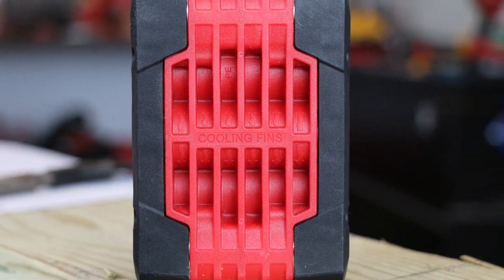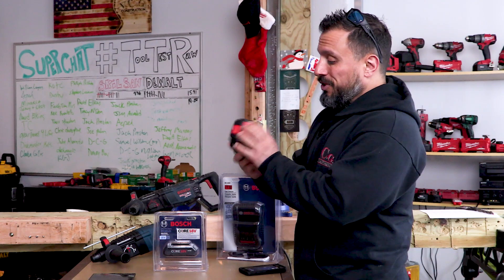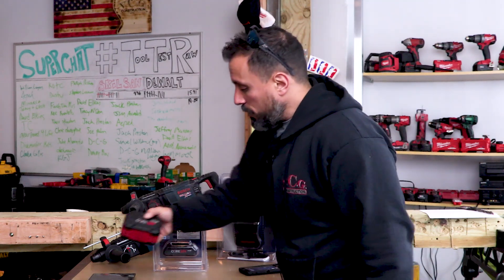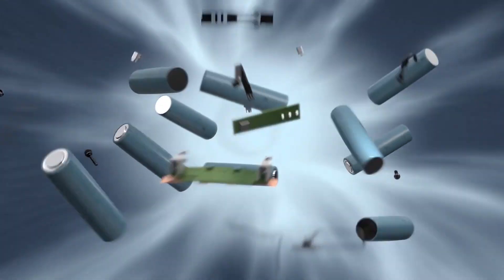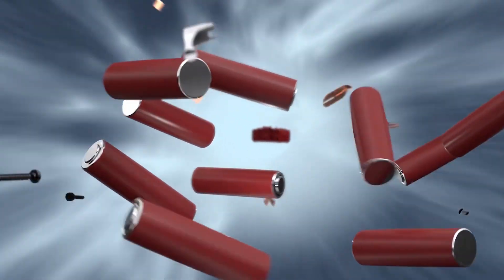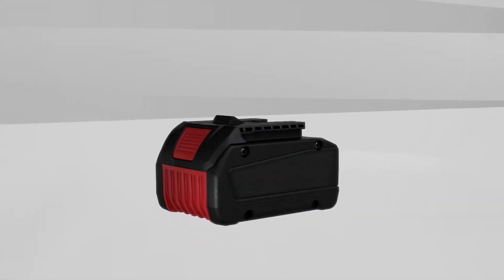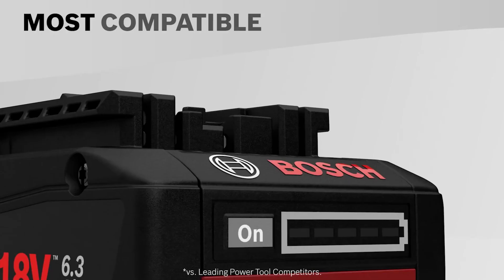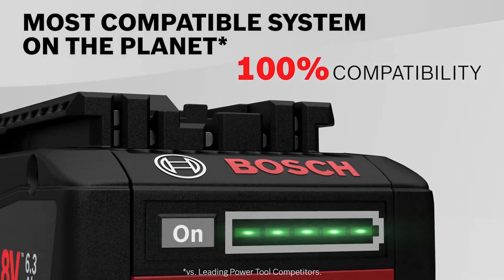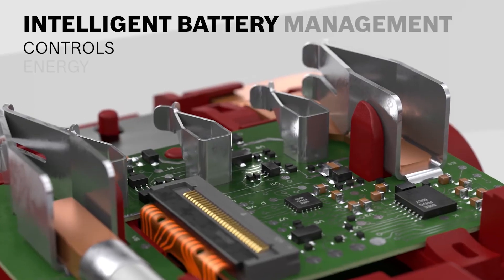It also has what they call cooling fins — though it's plastic, so how that plastic is actually transferring heat I'm not entirely sure. This 8 amp-hour battery will deliver 144 watt-hours of power. Although the package is small, it feels very dense. When we put this 8 amp-hour battery on the scale, it weighs 2 pounds 2.3 ounces. To get so much power out of such a densely packed array, number one they use the 21700 cell, and number two it's the way they position the cells in the pack.